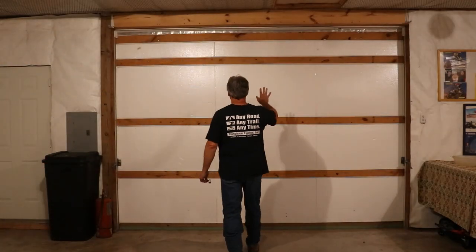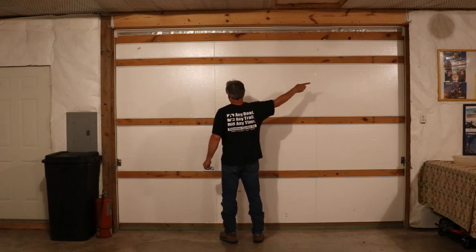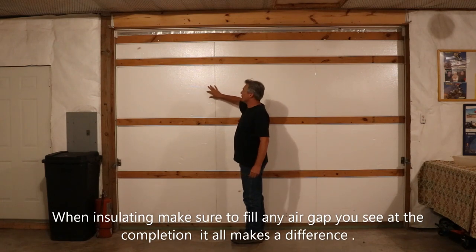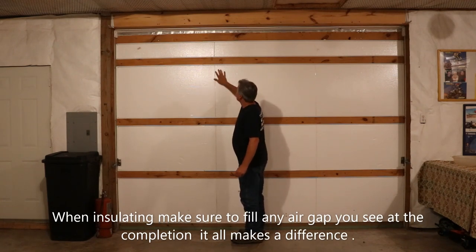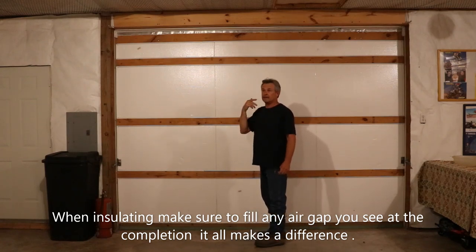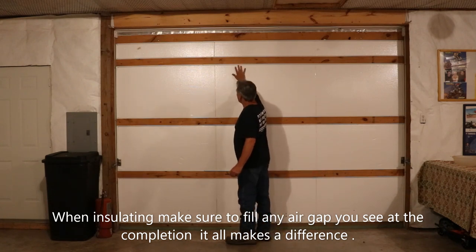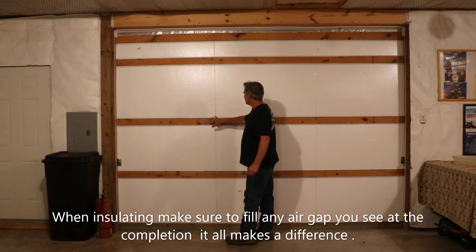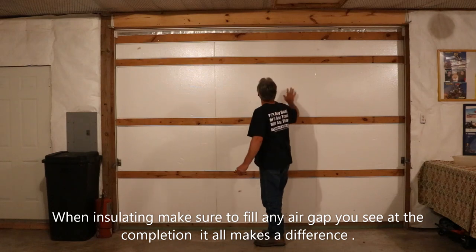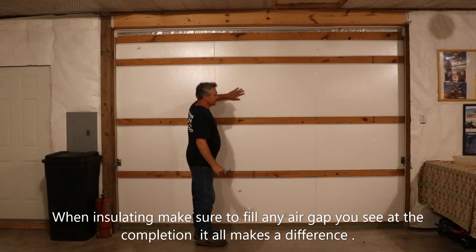What we have here is the sliding door for the building. It's going to slide to the right for us. I used a foil-backed inch-and-a-quarter foam insulation for the door panels. This was the hardest part in the entire building to insulate. Cut the panels to fit and trimmed them out with some plastic quarter round, and that gave it a nice effect. This does insulate the door pretty well.